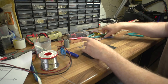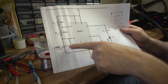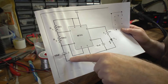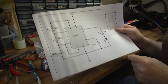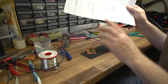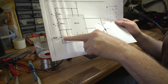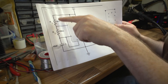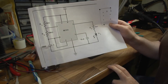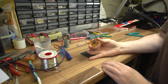If you wanted the LED to flash at a particular rate, look at the circuit diagram - it's basically the time constant between the capacitor and the resistor network. There's a formula for the NE555 which is all over the internet and you can figure out exactly what components you need for any particular speed. If you wanted a one second flash - this is a little bit too fast, it's good as a warning indicator - you could increase the capacitor value from 10 microfarad up to 100 microfarad which would slow it down by 10 times, or increase the resistance values. I didn't bother calculating it - I just got it off the internet and put it together to see if it flashes.